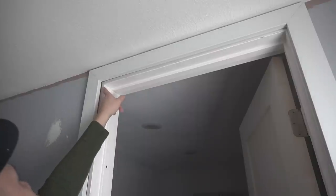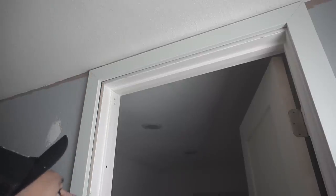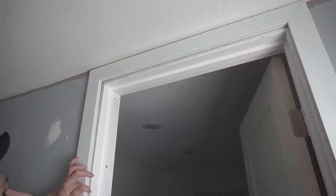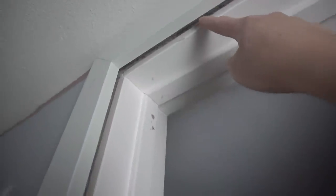We got our door casing on, and right when we put it against the mark it's a quarter inch on each edge — so we have that quarter inch reveal. But look what happens: there's a gap all the way to one side. The other side is flushed, while this one has about a half inch gap that tapers all the way down to a quarter inch. We have a quarter inch reveal around most of it, but as it goes around the gap gets bigger — from an eighth inch up to a quarter, all the way to a half inch gap.